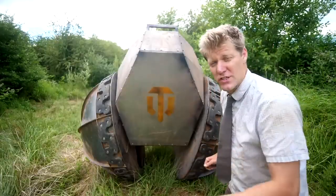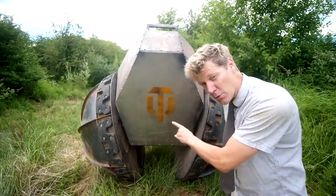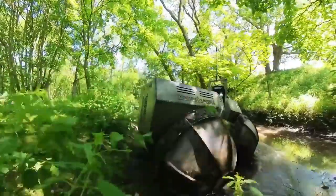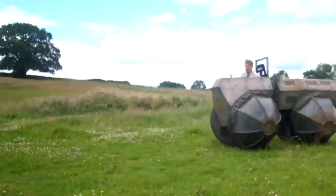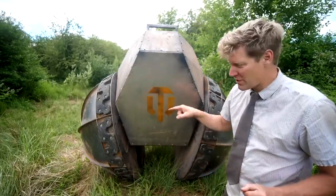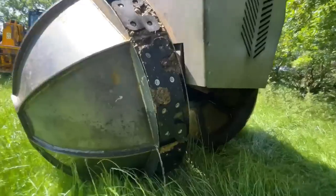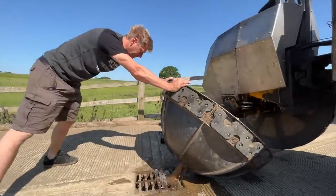I've asked way more of this dumper than it was ever designed to do, but it was the design of the wheels which inspired me. I can see the logic in the fatness — driving into mud, you do feel like yes, this is the way forward. However, you have to tilt them 15 degrees, and that's one of its downfalls: on a sharp turn the inner wheels lift and you feel like it's going to roll over. Also, the reason the army never took on this design — if they get shot and pierced, the wheels fill up with water. Even through a tiny weld hole, sitting in the river, I half-filled one of them with water, so I understand their concerns.